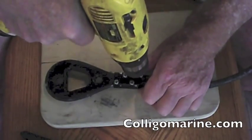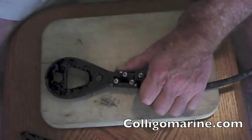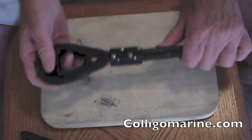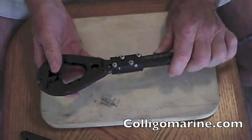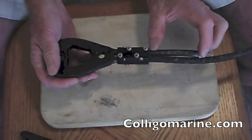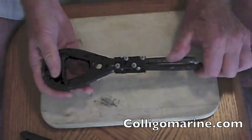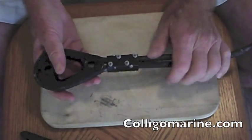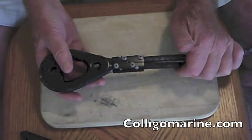Just drive them until the head is seated. You can see how that head is seated. Now, voila, we have the clamp installed, and that took all of about five minutes. What's really nice about this clamp is you can take it off — it doesn't really damage the line, believe it or not. So when we put our torque ropes together, we leave a tail about three inches on each end so you can actually adjust the length. You can stick it on the boat; if your length is off slightly, you can change it and optimize your rope length for your hoist length.